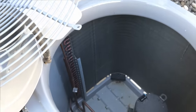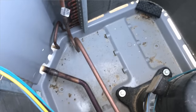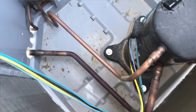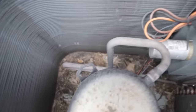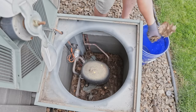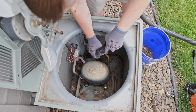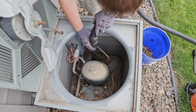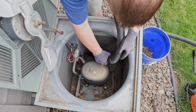Once you have the fan removed, take a quick look inside your unit to see what's in there. This one was cleaned about a year ago so it's not too bad, but in this example from another one I cleaned for a friend last week, it is pretty filthy — he wasn't sure if his had ever been cleaned. We actually scooped most of the stuff out with our hands and vacuumed the rest with a shop vac. You want to get as much of that debris out as possible so it doesn't get sucked into the fan or interfere with heat transfer through the fins.